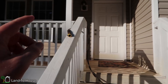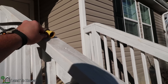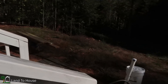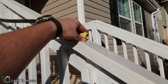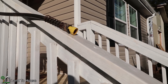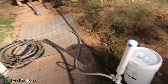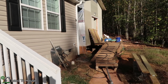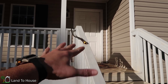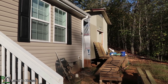If I want to use the top one, I have to close this one off. There's another thing to consider if I open this all the way — there's probably not enough back pressure here. Yeah, the pump stopped. So I close this after filling up some tanks, and then the problem is that back pressure that was on this side has flowed back down to reach this height. So there are some strange back pressure issues going on that may cause the system to stop.